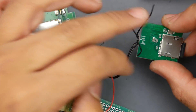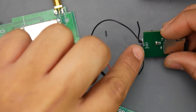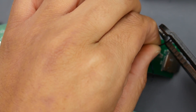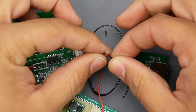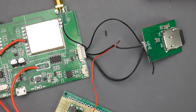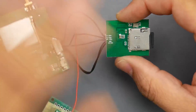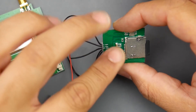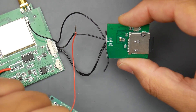The video in and video out wires are not connected anywhere yet. Now we need to find the video in wire — the top one here — and connect that as well. With this, we should be able to record only from the Fat Shark module, so we still have DVR function. The DVR module's original video output going to the goggle is no longer connected — we don't need it to output anything to the goggle anymore. All we need the DVR to do now is receive the video input from the Fat Shark module so it can record.